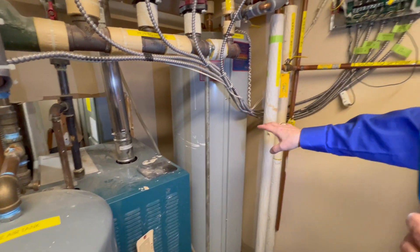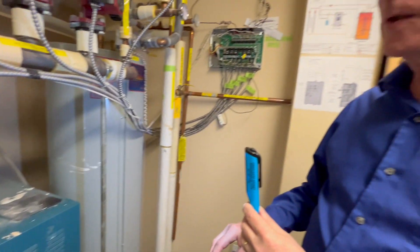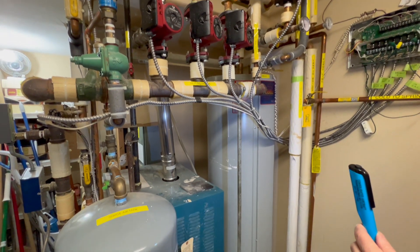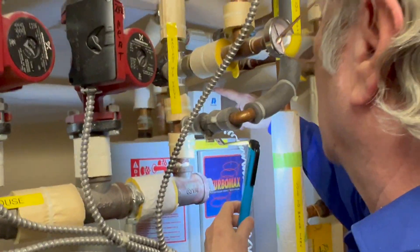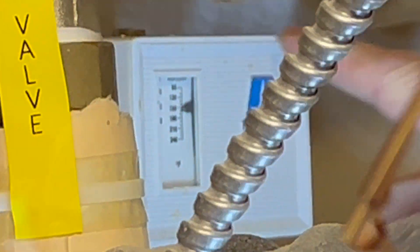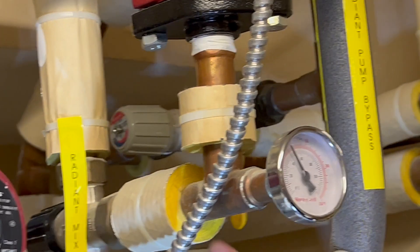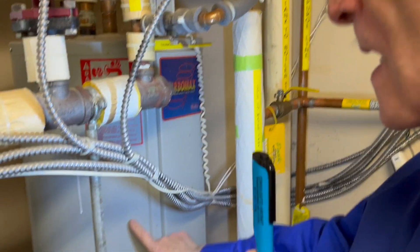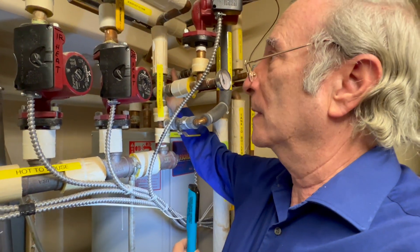The combination of a boiler and a hot water tank is a brilliant idea — it gives you instant hot water all the time. It's pretty rare that you would ever run out of hot water; that's what they brag about. This paired combination gives you hot water all the time. Here's the thermostat on the hot water tank. Since the mixing valve is jammed, I've actually turned off the cold water feed to it, so all the water going to the house is hot water out of the hot water tank — the mixing valve is basically disabled until we call a plumber.